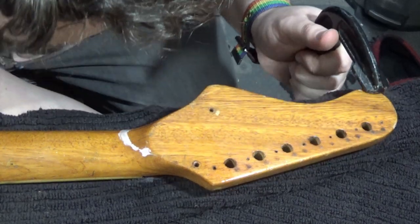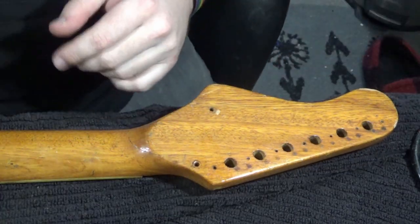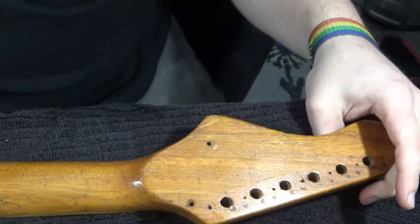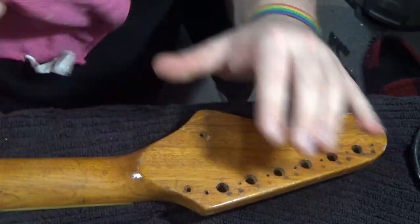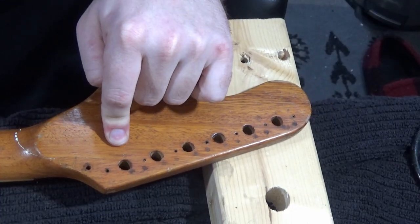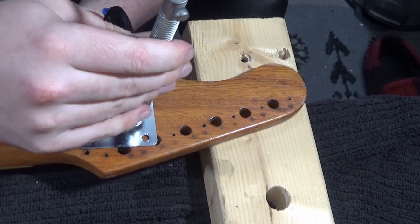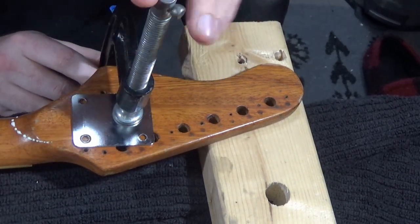This crack closing up. Oh, look at that. A lot of glue squeezed out of that crack. Make sure there's no glue on anything that I don't want there to be glue on before I do anything else. Oh yeah, look at that. Beautiful squeeze out. I just sprayed myself with water. But now I gotta clamp this headstock down like this. Okay, I'm actually going to bring myself in a little deeper this way. There we go. We're getting squeeze out along the entire crack.